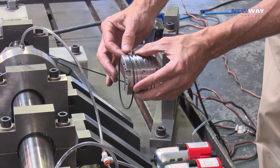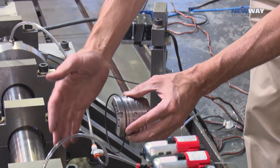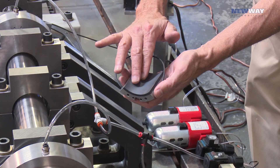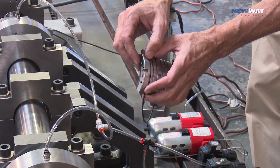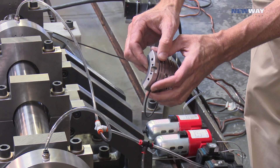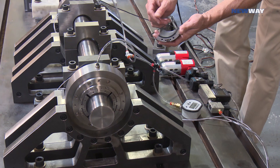That bearing preload comes from compression of the O-ring between the back of the bearing and the inside of the cartridge here. And it's the pressure that's exuding from the porous face that pushes the bearing into the O-ring, which both provides compliance and damping, and frictionless motion of the shaft between the face of the bearing and the rotor.